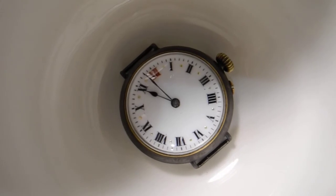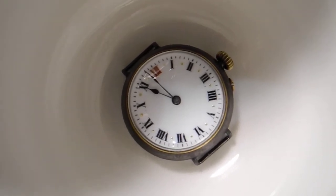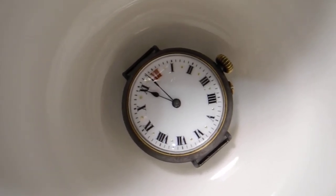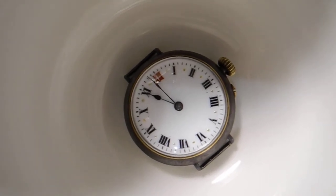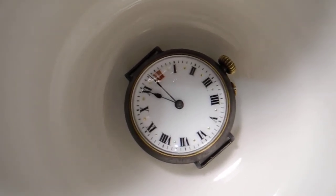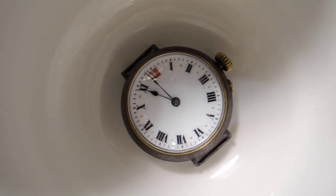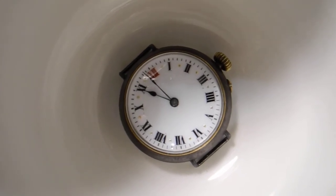It would be nice if I could get the beat better, but that would mean moving the collet on the balance wheel possibly, or moving the hairspring on the regulator. I'm not sure whether I'm up to doing that or not. I'll have to come to a decision on that at some point. So we'll just leave you with another 10–15 seconds of it ticking.